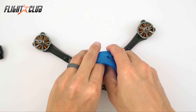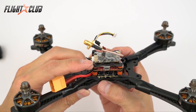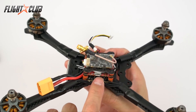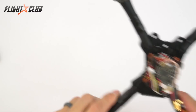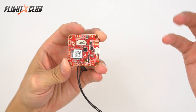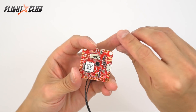Here is the XSR-F40 in the Proton build. As you can see it's super clean — the stack is so small and simple. This uses 20mm screws, so the stack is actually less than 20 millimeters. I've got the IS30 ESC flipped upside down to make more room for the XSR antenna wires, which are replaceable. It's set up with the TBS Unify. On paper it doesn't look like the XSR-F40 has many UARTs, but if you consider that the built-in XSR takes up two UARTs — UART1 for SBUS and UART6 for SmartPort — that's the same as any regular flight controller with an external XSR anyway.